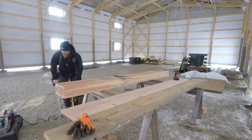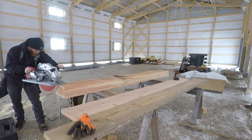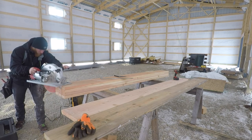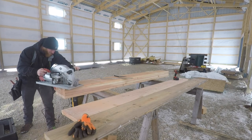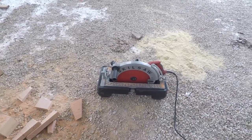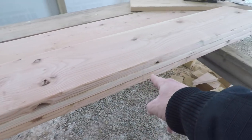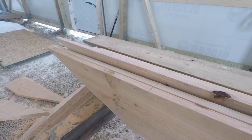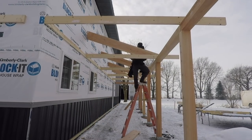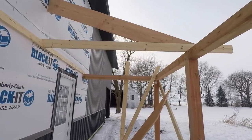Now that they're screwed together I can go ahead and make one cut and get through all four at the same time. That's a sixteen-and-five-sixteenths-inch blade — I can gang cut four two-bys at one time. Just made up these rafters real quick, got them marked for my purlin locations, and they're all ready to go. We'll take these out to the porch and get them installed. I hate ladders — I'd rather work off a scissor lift all day, but even my MRT260 doesn't fit in here.